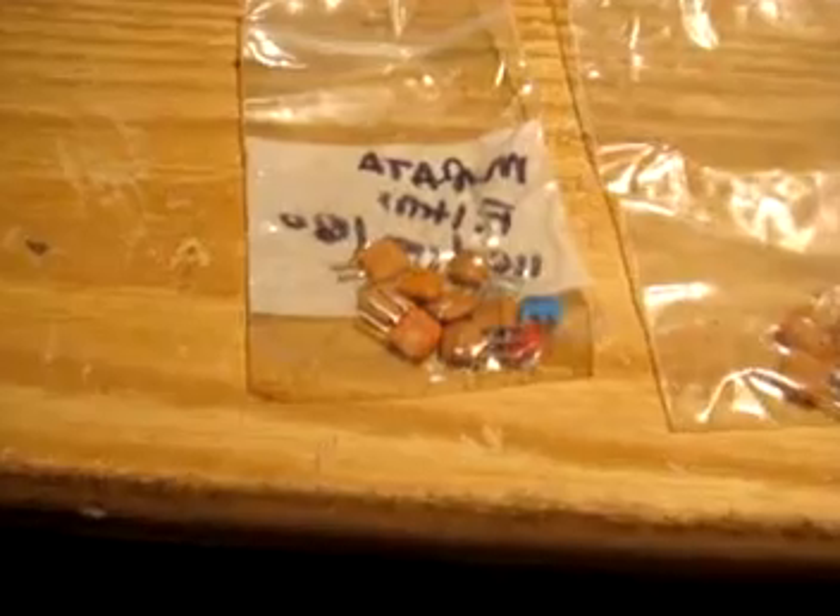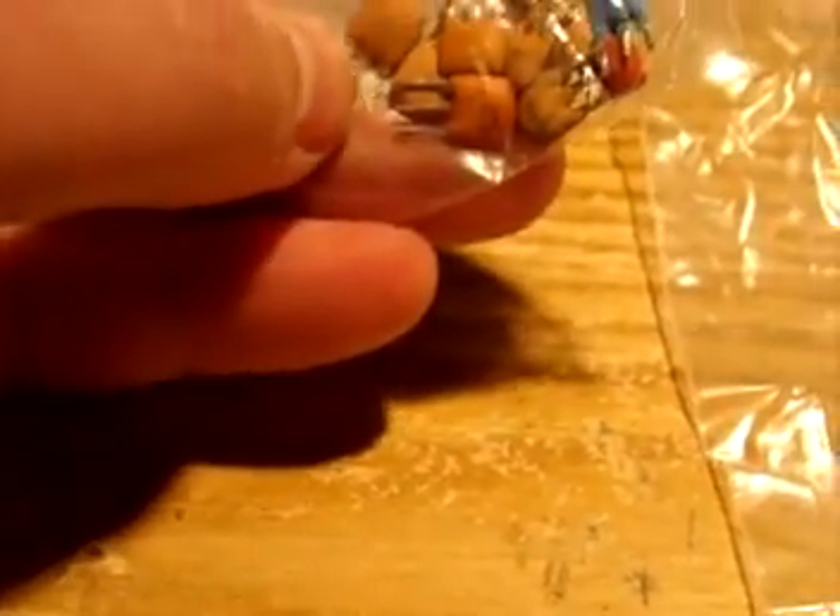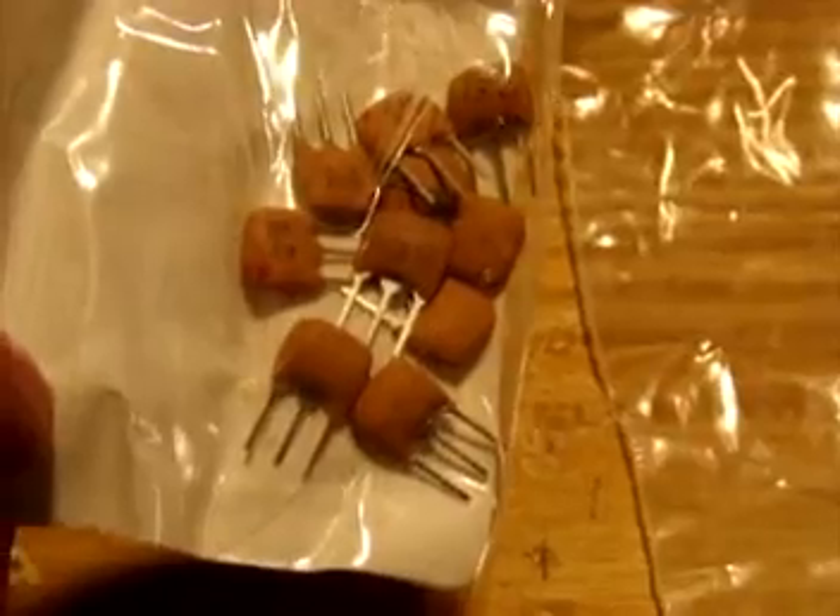For those of you who haven't seen Murata filters before, these are what the ceramic IF filters look like — little three-lead pieces. These are some older ones: there's some 230 kilohertz, there's 150 kilohertz. They're usually stock at 320 or 280 kilohertz. What I'm going to do is put in these SNR brand 150 kilohertz filters, which are pretty good, but you can do better. You can get these Murata 110 kilohertz filters — those are the ones you want.